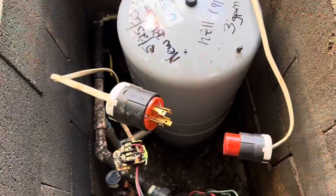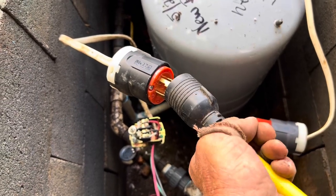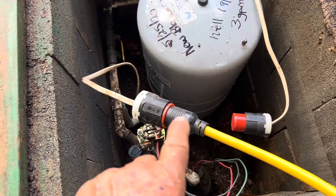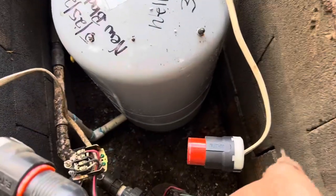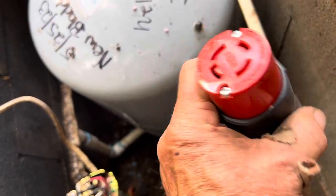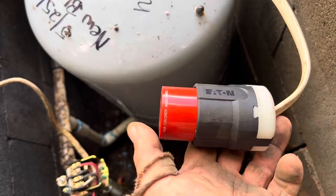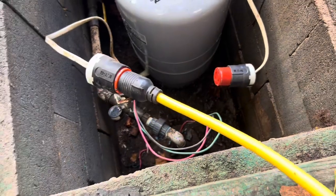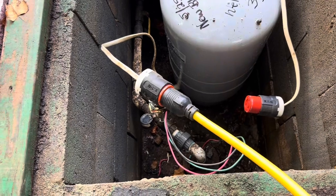Here it is in the well. We've got the plug. The power cord from the generator will plug into this one, and right now it would be running off the generator. Male and female coming from the generator has got to hook up this way. The other thing about this is this is the end coming from the house — should the power come back on, it's just the plug end and nobody's going to get shocked because the plug is just sitting here, whether it's alive or not. This is completely isolated from the house. You don't have to worry about the generator backfeeding anything.